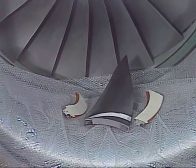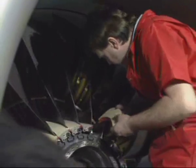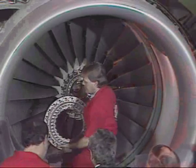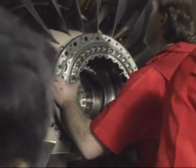The moment weight of the fan blade is identified on the bottom face of the blade root. For the installation, align the replacement blade with the disc dovetail and install the two annulus fillers to their initial position. Then reinstall the front blade retaining ring and secure it.